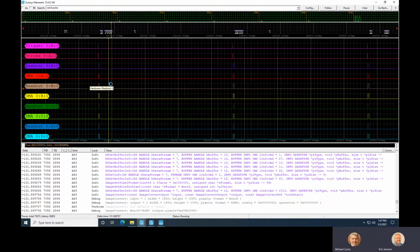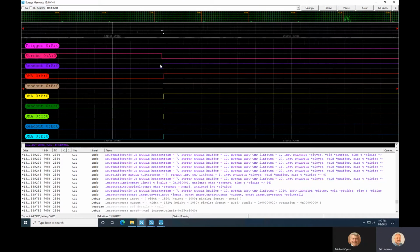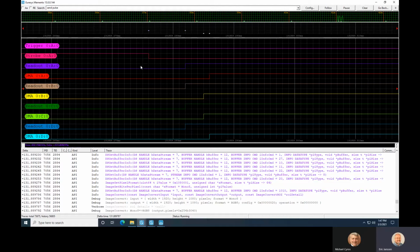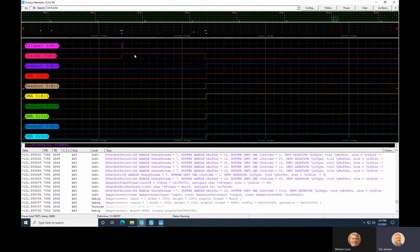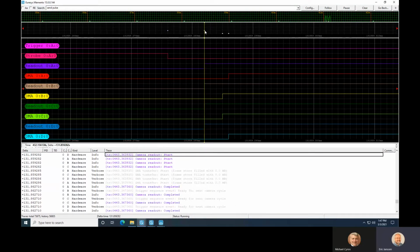That looks good, Eric, but how can I actually measure really precisely what the trigger accuracy is? So we can zoom in here. I am now zooming at 1 microsecond per square. I've lost my trigger a bit here; the trigger is very far, it is here. So I zoom here. These are all the readouts, and I can see that all my camera readouts happen on the exact same microsecond. And as I have 1 microsecond accuracy, this is the best I can measure.